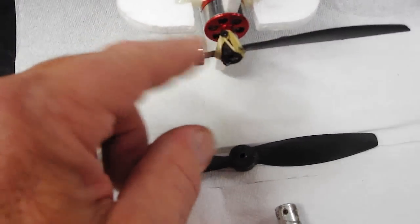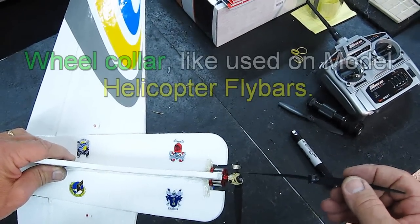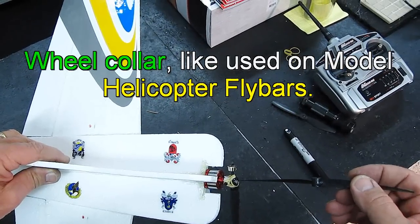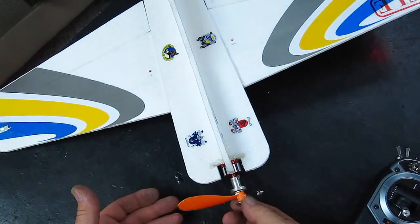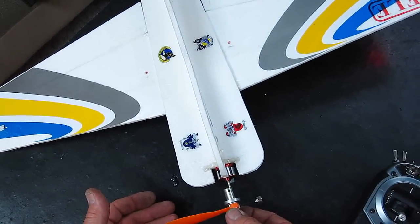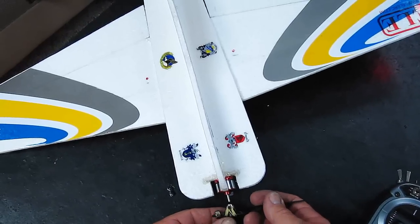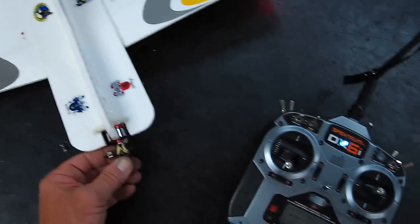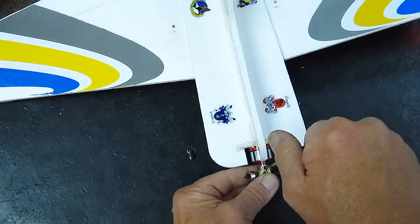First, if you broke the prop, this is the way I did it with carbon fiber and weight. I put a counterweight on here — a carbon fiber rod — drilled it out, made sure it's in tight. There's an Allen screw on both sides. This is the way the other one goes on; I used a different adapter, not exactly the right size, which is why it's not quite as smooth. And this is the way the stock one goes on — just tighten the screws down on the side to hold it down.